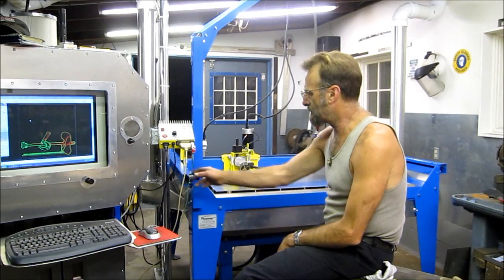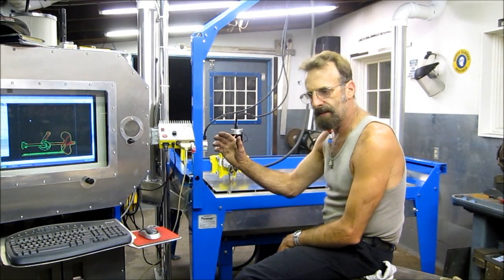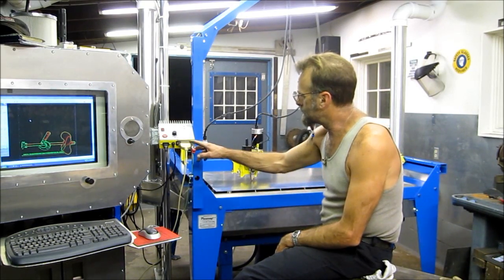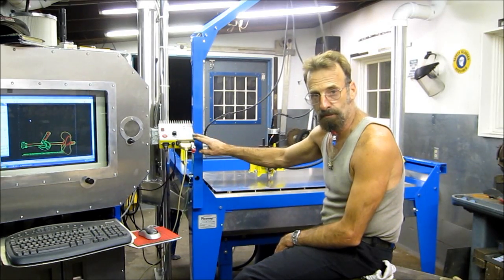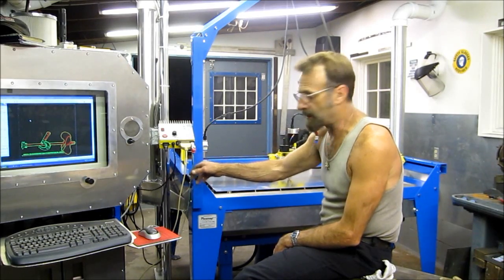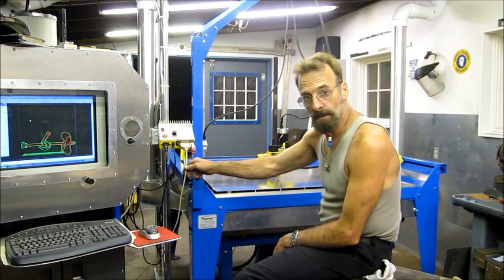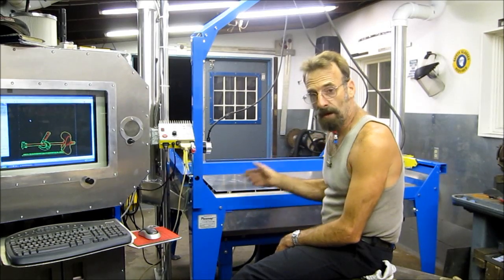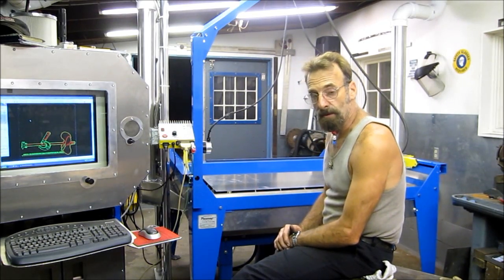Today I went ahead and added a ground from the PC housing up to the metal clip contact area for this brain. The two brains have got to share a good ground in here. Otherwise the signal coming through the parallel cable is giving missed signals, and that's why I had to stop in between on the program.